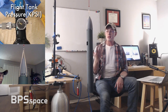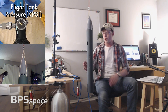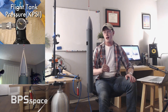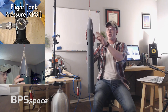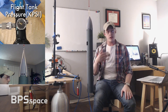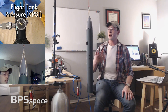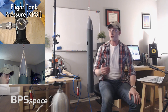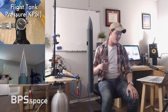The last time that I streamed live testing of the reaction control system, I had actually done testing before on the impulse of the thrusters. I had dialed in some of the PID gains just a little bit. That is not the case today. I have not tested roll thrusting on this yet. I've done just a little bit of testing with low pressure air to make sure we have all of our plumbing inside the vehicle correct. But we don't yet know the proper PID gains. We don't know the sensitivities for the control laws that we want yet. And so this means today's test style will be a little bit more experimental. So there will be more tests that look bad today.